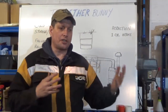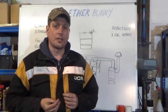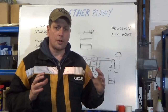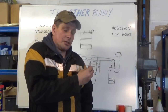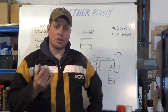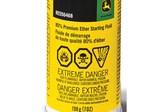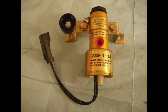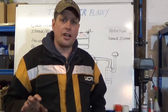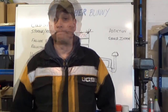Engine technology has moved on so much in the last 15 to 20 years. Nearly all diesel engines now are direct injection, and heater systems — block heaters, head heaters — are so much more advanced and efficient. Looking back at older engines though, manufacturers actually fitted ether systems to a lot of engines. I'm talking the likes of Perkins, Cummins, CAT, and manufacturers such as John Deere, Farmall, Oliver, Allis — they actually fitted ether systems for cold climates. And to be fair, if you honestly believe ether should never be used on an engine, then don't, because you obviously don't understand ether and how to use it.